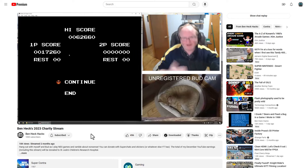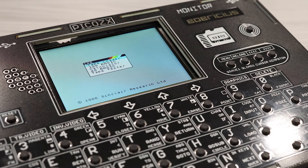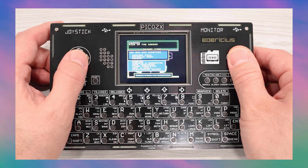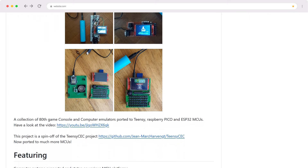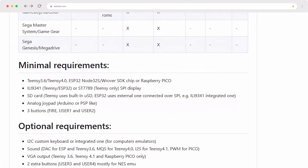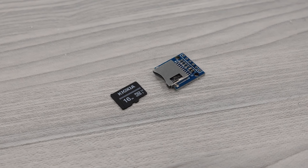So there'll be a new version of the Game Badge. I don't remember being quite that enthusiastic, but I did think that emulators would be a cool addition. I was working on another project at the time — a Pico-based handheld ZX Spectrum emulator called the Pico-ZX. While working on that, I came across a project called MCUME, the Multi-Computer Machine Emulator, which ports different emulators to microcontroller platforms including the Pico. It already had the option to use an ST7789-based LCD driver, but it requires an SD card for the ROM files.